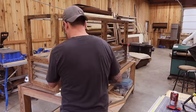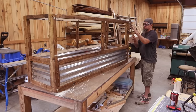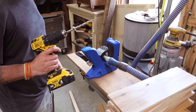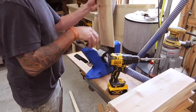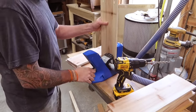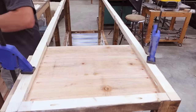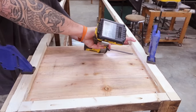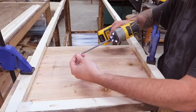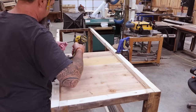The next step — we're going to be using our cedar fence pickets. Just an FYI, the only ones that I could find were closer to one half of an inch than they were five eighths, so I sanded these down to a half of an inch. These boards will be part I — they're going to make up the bottom shelf of this cooler stand. And now we're going to put pocket holes in the ends of every part I. Since some of these thicknesses are a little different, I actually like to use the 720 for this. It would be a lot easier to run these boards just straight across the base, but I want these inset. So to help with this, with the stand upside down, I'm actually using a scrap piece of plywood going all the way across my rails to ensure that when I flip this over, all of my boards are flush with the top rails. Yes, it would be much easier just to install these from the top and make the boards a little bit longer, but it would not look as nice — it'd look like everything else that's on the market.